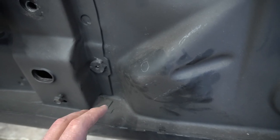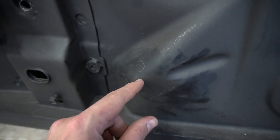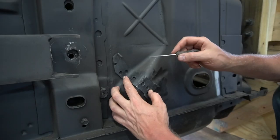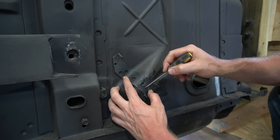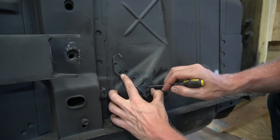I don't have measurements to go on, but I know this is about the location of the original because I traced around the floor pan. I'll mark these holes and put some weld-through primer there. This hole right here is a factory hole — I'm assuming it's a drain hole in case water gets behind here — and then these three holes are spot welds.